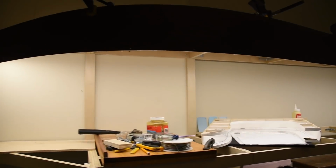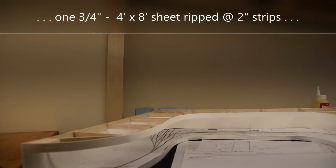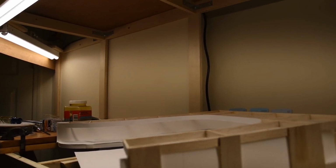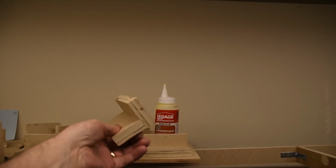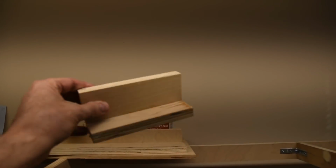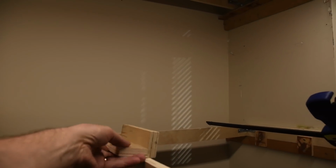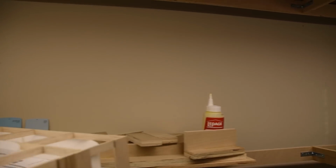Like I say, it was one sheet of plywood. And then let me just show you what else about the cleats. Remember I showed you some photos at the beginning there. These are invaluable, right? Just run 2-inch glue, pin with brad nails. That's all you need. And then when it dries, just buck them up. These are just fantastic for doing whatever, risers, for corners, for mounting lights. Cleats are the way to go. I've been using them for 20 years.